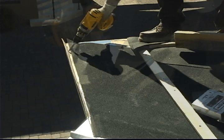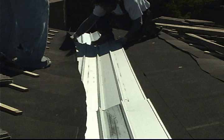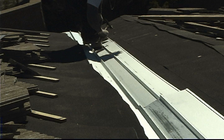Once that underlayment's installed, now let's get those batten strips down. It looks like the guys left a valley detail out of normal sequence again so that we get to see how it's supposed to be done. Notice how there's a vertical bleeder strip underneath the valley metal, and then how all the other underlayment comes and meets it from the sides and laps over the top of that.